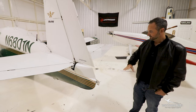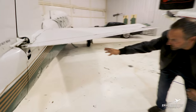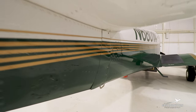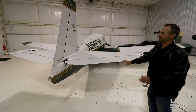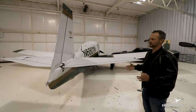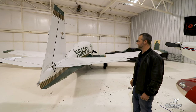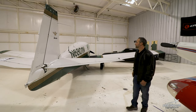Something I always try to do on the pre-flight is just move the tail — that's going to check the play in the jack screw to make sure there is none. The jack screw is located just where the sheet metal is protruding, and that's actually where the entire tail moves — which again creates less drag. On short bodies, the elevator will tend to stay up a little bit. The springs — technically called bungees even though they're basically a spring — Mooney calls those bungees, and it just lifts the elevator a little bit.